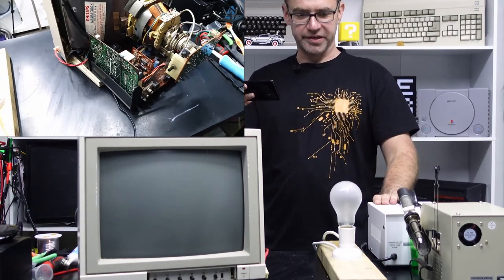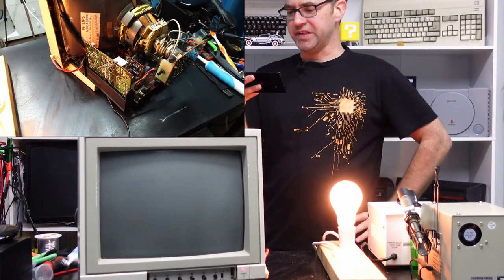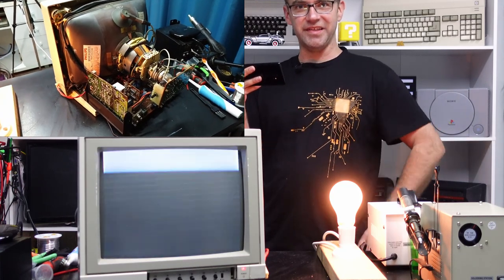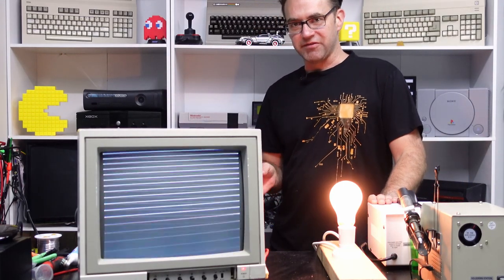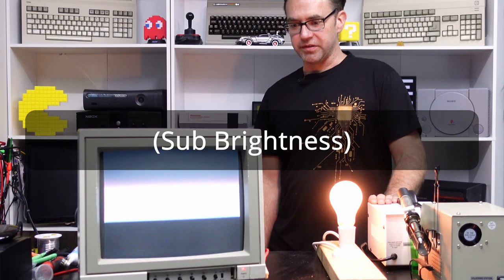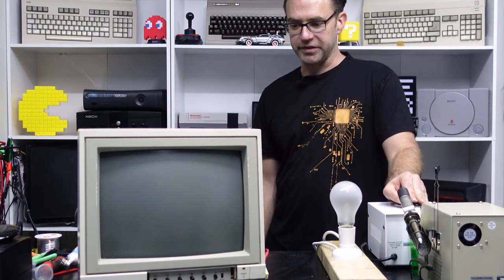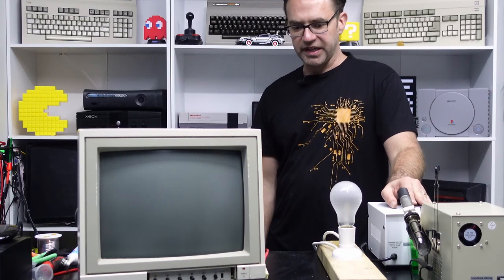The degaussing coil is disconnected so we should see the light come on and hopefully stay on this time. I instantly heard that static and I can definitely hear the high-pitched whine, so the display is working — I can see it in the viewfinder on the other camera. Looks like we've got a rolling picture there. The screen brightness is up too high — and when I say screen brightness I don't mean the front brightness control, I mean the screen pot on the flyback — because we shouldn't be seeing all those raster lines. We need to adjust that.